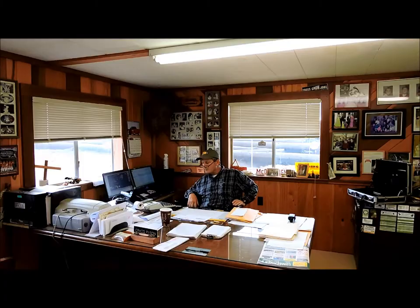want a 54-inch. We've got two 7-foot band mill head rigs, and we've got a 62-inch horizontal resaw, and we thought if we could get a 62, we could feed it faster, cut more production, just get more utilization out of it, you might say. And then we thought we could take our saws off that double cut and put on a horizontal just to give us a little more return on our investment.